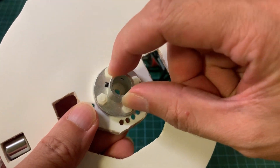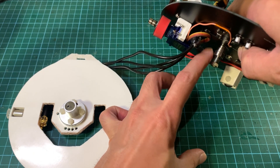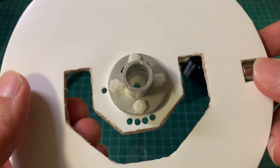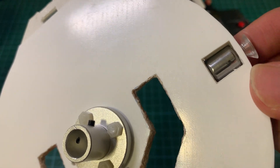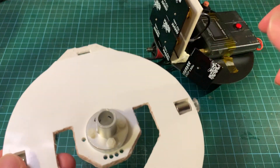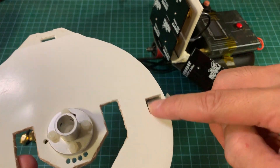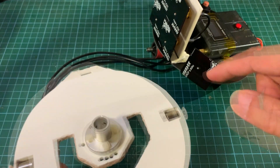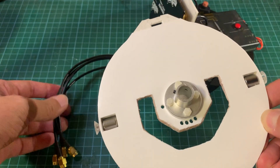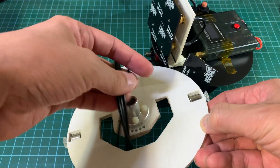At the centre we have an aluminium hub which holds the pivot. The pivot consists of a 4mm screw and 10mm outer diameter bearings that fit right into the hole of the aluminium hub. These are one-way bearings — the bearing turns in one direction and not the other. These act as idle rollers that stop the turntable from rotating past a certain point — once the drive wheel comes in contact with the one-way bearing, it's going to idle and roll on the spot. This prevents the turntable from turning round and round and tangling the coaxial cables, which are routed through a slot and won't turn past 180 degrees.